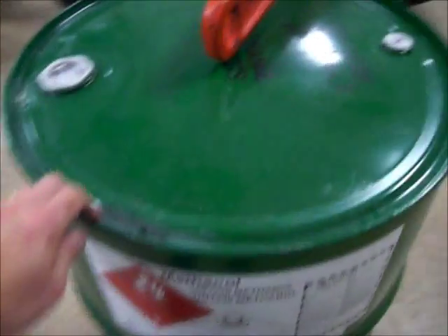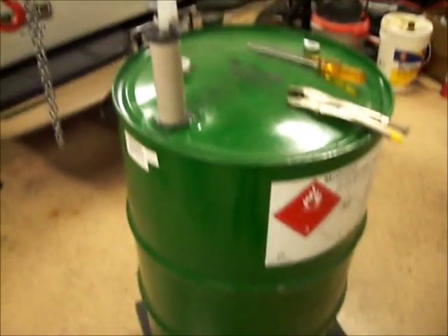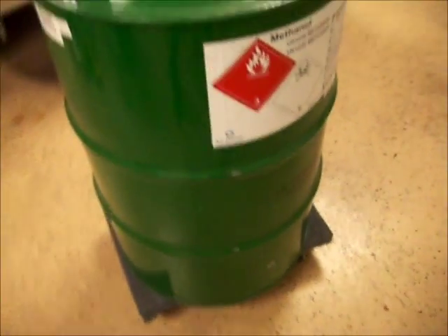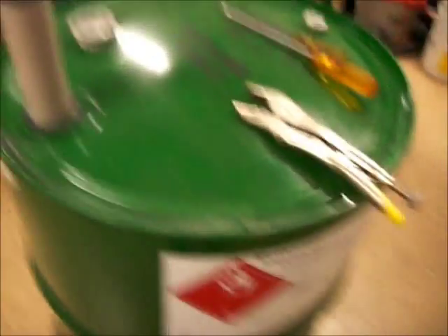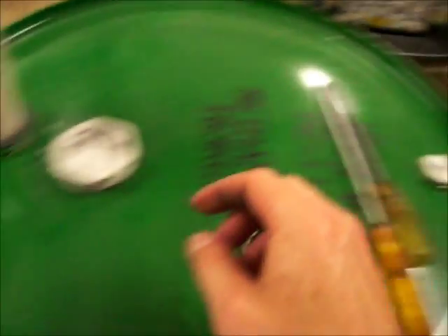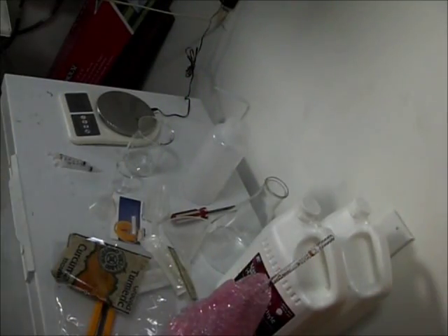We got the methanol down off the truck and onto a wheel dolly so we can move it around. It's not super heavy — only 163 kilos for a 200-liter drum. We need to get a pump in there and get the bungs open. Keep in mind this is essentially a 200-liter bomb. Methanol is what they run in Formula One cars and top fuel dragsters — when it burns it's colorless, pretty much odorless, and you'll get burned alive. Try not to use metal tools on this; that's why they use plastic bungs and our pump is totally plastic. Keep sparks away.